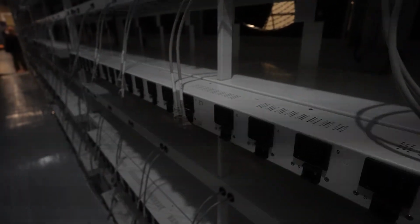So there's going to be pockets of hot air. That hot air will get stuck. It will not get sucked out in time, and it will then blow back on the miner, and that can cause problems. Now, this is only going to be an issue during the summer. It's not going to be an issue when it's cold outside.